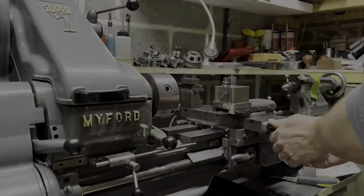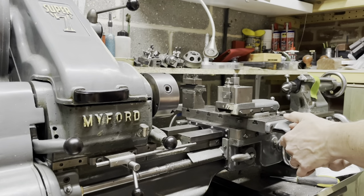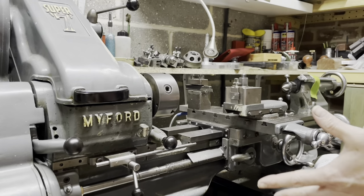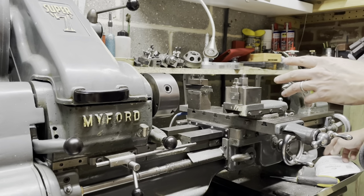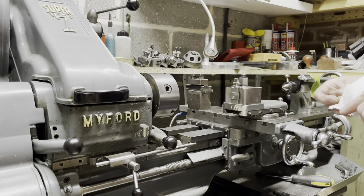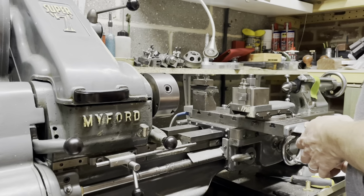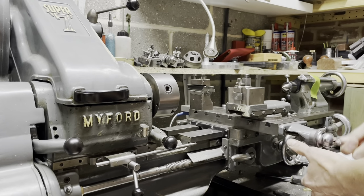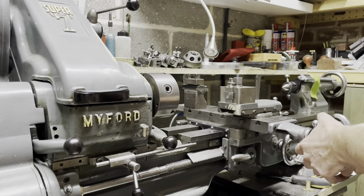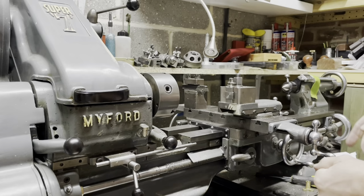2. Now, this is most likely due to wear and tear over the years and years and years of use this machine's got. I initially thought the nut had gone, and without thinking, I jumped ahead and bought a new nut. It's not the nut, because at the very end here there's almost very little backlash, but the backlash is quite severe and gets worse and worse in the middle. So that tells us quite quickly that the lead screw is worn out.